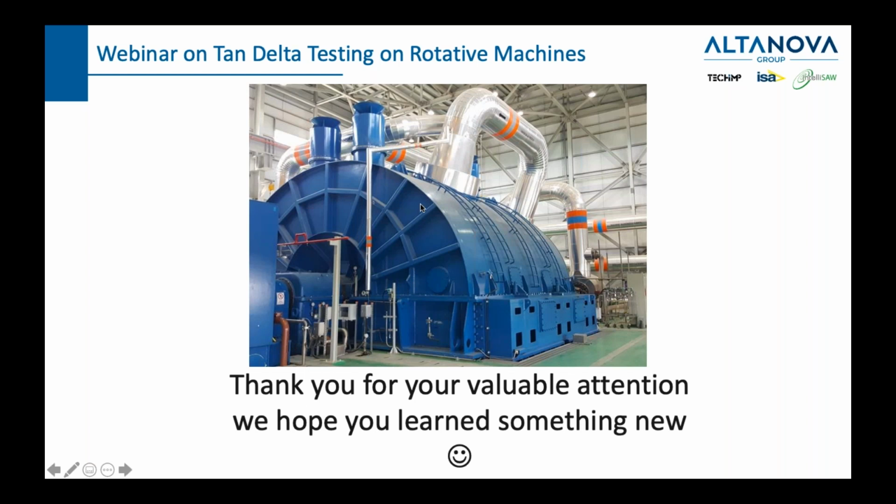Okay, if tan delta values are increased but capacitance values are the same in comparison to the previous result, what may be the cause? In that case, you have a problem with the insulating properties, which means that the mechanics has stayed the same, but epsilon, the ability of your electrical insulation to insulate electrically, has decreased, because you got some molecules of water inside, because you got some other impurities, because you got maybe some voids. Your electrical insulating capabilities are decreasing.